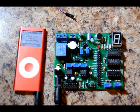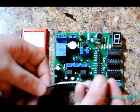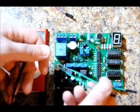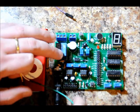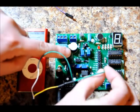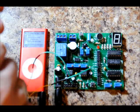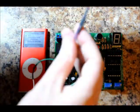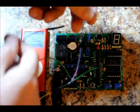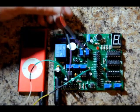The transmitter circuit is very easy. Your audio peripheral connects into your iPod or MP3 player. It's got two wires — white and yellow. White is ground, yellow is signal. These are just wire extensions so you can plug into the board. Connect your white to the common ground line on the power supply pin block, and signal to A1-plus, the input of our first non-inverting operational amplifier. We'll take our laser peripheral, which has two wires — red and black — connect our black to the power supply ground and our red to the output of the amplifier. That is our transmitter.